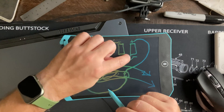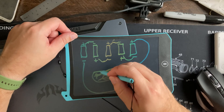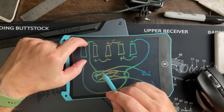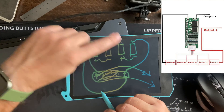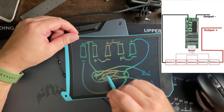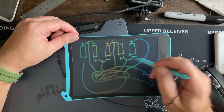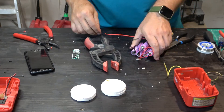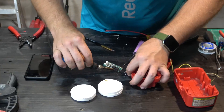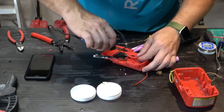You're also going to have four other wires coming off the BMS board. Their job is to make sure that each individual battery is charging evenly, because an imbalance can cause issues with the battery pack and make it go bad. You run one wire to each of the bridging connections between cells, and it also reads the terminal voltage. Each connection on either side of the batteries allows the system board to read individual cell voltages to make sure things aren't too out of balance.